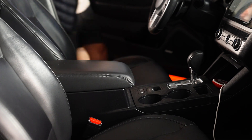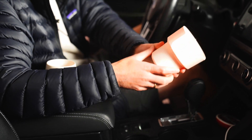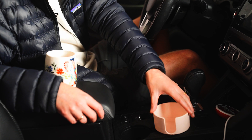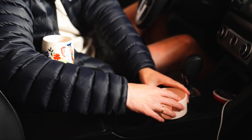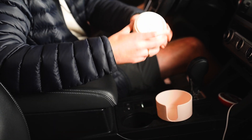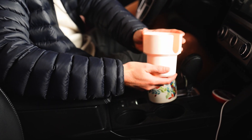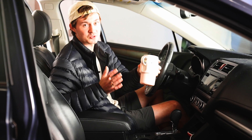Alright, here is the test — will it work? Here we have the brand new cup holder adapter, and it obviously has this cutout. It feels strong even with two walls and cubic infill at 10%. Let's see if it will fit — that is great! It fits perfectly, it's tight, it doesn't even wobble at all. It's actually better than it was before. I did make the top portion a little bit wider to fit more types of mugs. Here's our pretend mug with the big handle — boom, fits perfect! So 3D printing is extremely practical.